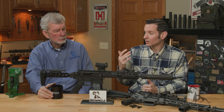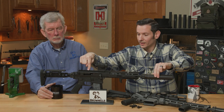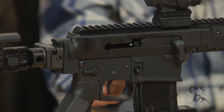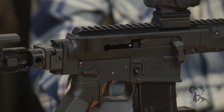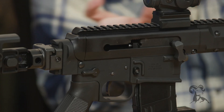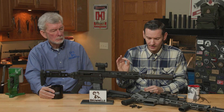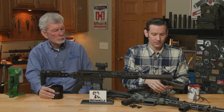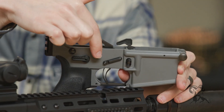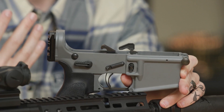Now I know I'm saying anti-walk or anti-rotation — those are two different things. If you look at this firearm right here, the pins are not actually connected; there's no bridge holding them together. These are just anti-walk pins, which means they'll still rotate — they just won't walk. Walk is a lateral movement, walking out left or right of the receiver causing an issue. Now an anti-rotation pin is something like this right here, where there's a bridge going from the hammer to the trigger pin, and what this does is prevent them from rotating at all.